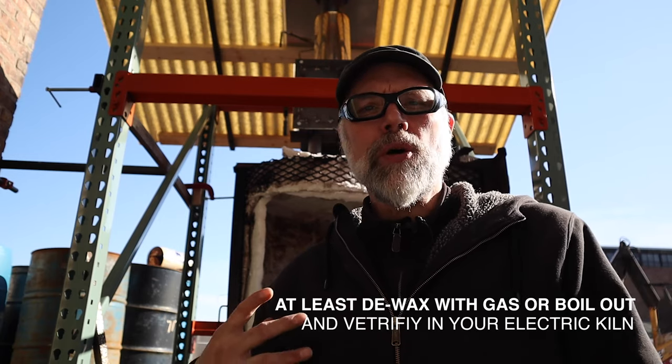Today, we're going to talk about the main way of getting the wax out of the investment. But really, your kiln needs to be just basically anything that'll hold heat. It doesn't matter what your refractory is, whether you're using a wool blanket, soft brick, hard brick, or an electric kiln. Actually, de-waxing in an electric kiln is problematic because it totally trashes your elements. So if you can do it with a gas situation, that's ideal. And if gas isn't an option, we'll talk about other options in upcoming videos. But for today, I wanted to stay on track and keep focused on a gas-fired, or specifically a propane-fired, burnout kiln.